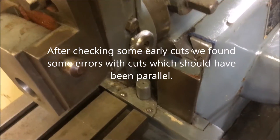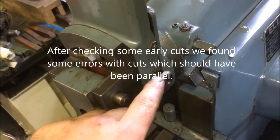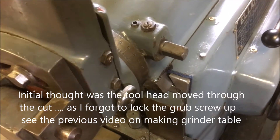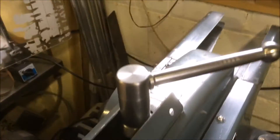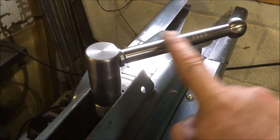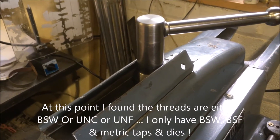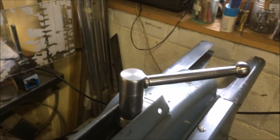I made myself a thumb screw for the compound slide on the shaper, so I can lock that up and make sure nothing moves. It saves fiddling around trying to find an Allen key and then dropping it. I also put a handle on the top for setting the start and stop of the ram stroke position. It's a bit higher than I wanted, but this means I can actually hold that point and wind that round.